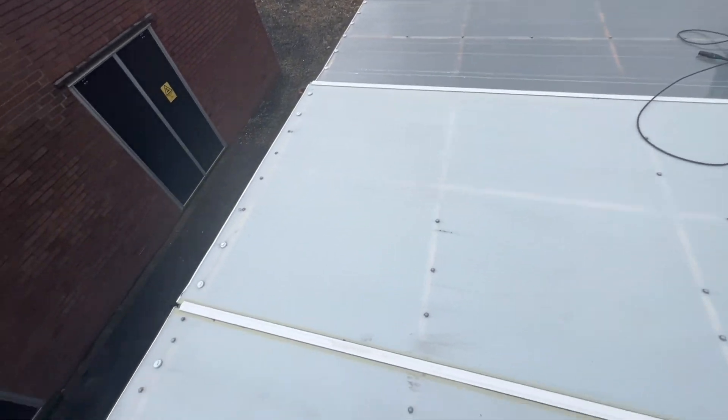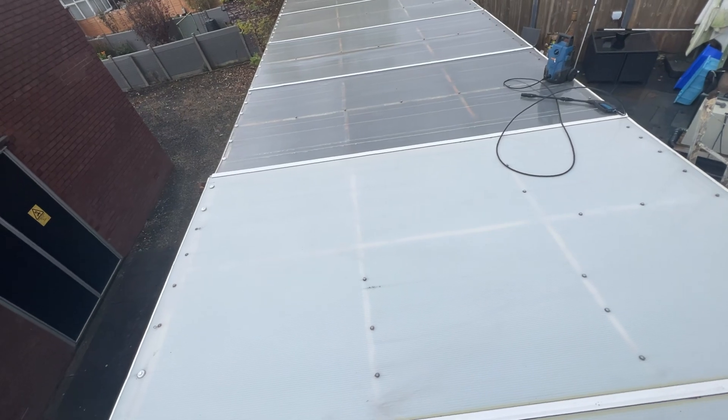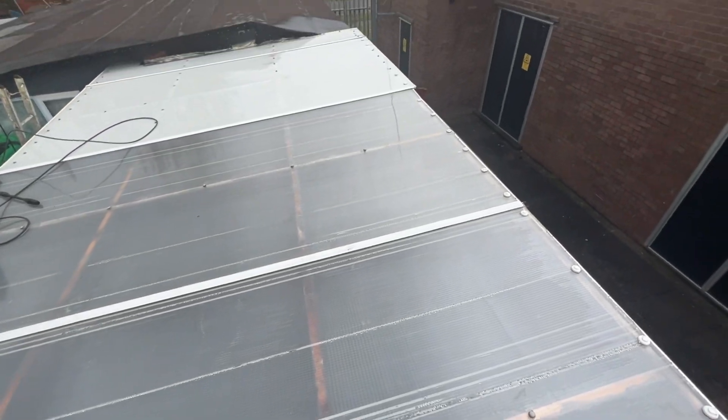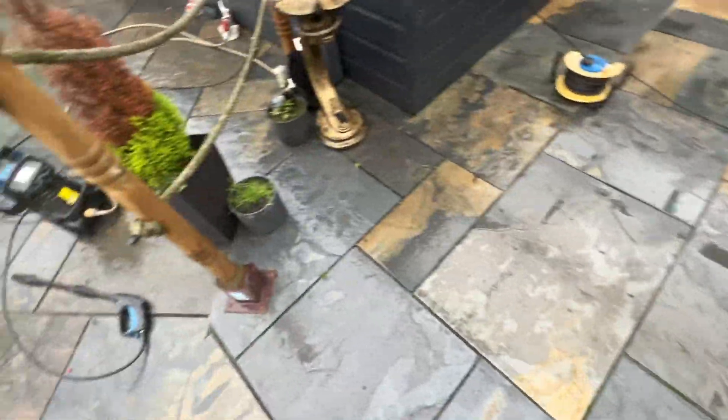The jet wash is done - let's put some 3x2 all the way across there, double it up so it's got a bit more tilt on it for the roof and the solar panels. When I'm standing on this roof as well, make sure I follow these joists - stay on these and keep standing on them. If I don't stand in the middle I'll fall straight through, and then we'll have a big hole in my roof. So underneath there as well, I'll be taking that down. This is my seating area which will be a pond eventually as well.